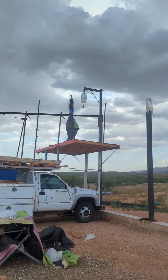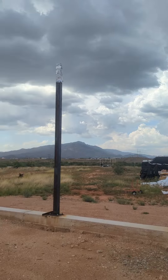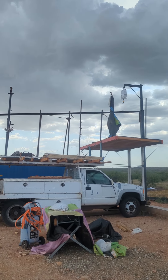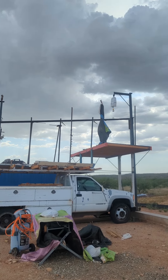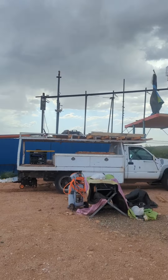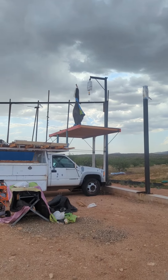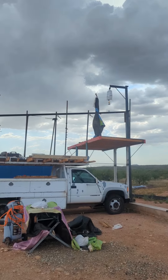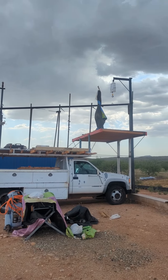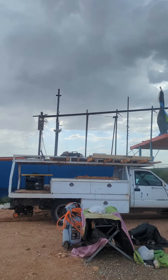One of the challenges we ran into was that we wanted a single slope building — a mono slope — because for our rainwater collection I wanted it all on one side of the house. I didn't want elaborate gutter systems, and I wanted overall simplicity of the build. It's about as simple as you get, except for the trusses. We also wanted a clear span build — an open floor plan where the trusses span without support in the middle. I could have gone with an I-beam but those were really expensive, so I decided to fabricate my own trusses.